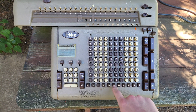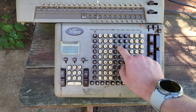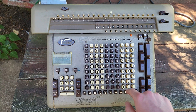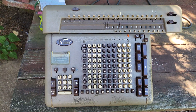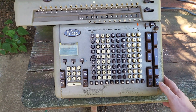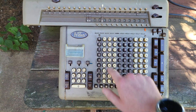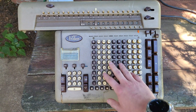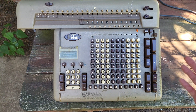So that one shifts all the way over. Now if we do the other one — 65,536 — and push this button, watch how far it shifts over this time. See, it stops here and has to advance one position again for division. All the left buttons will shift out to position eight, all the right buttons shift out to position nine. And that's why they have these all duplicated — it's an operator ease feature so you don't have to figure that out.